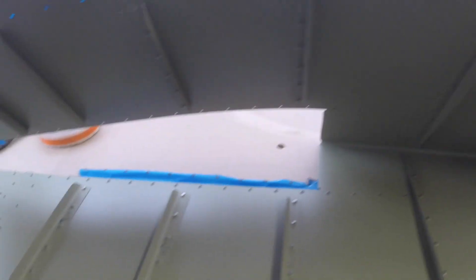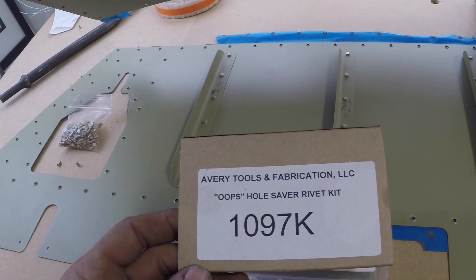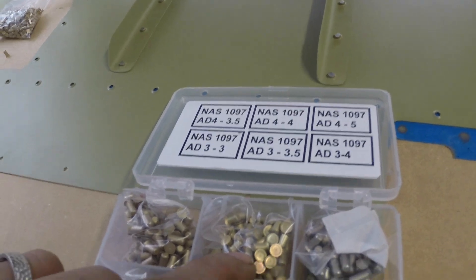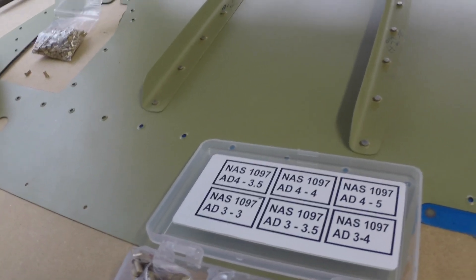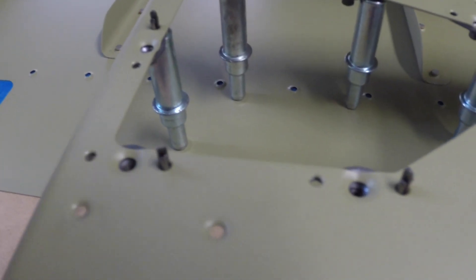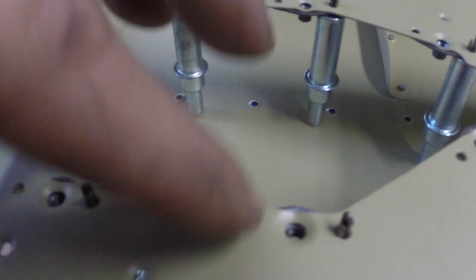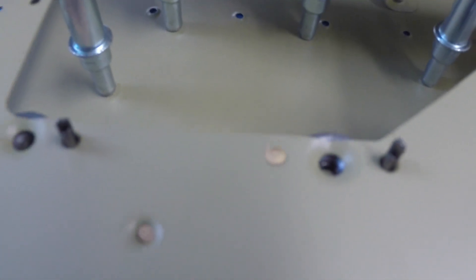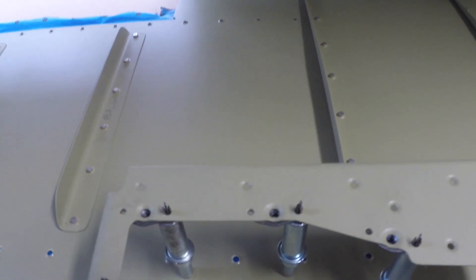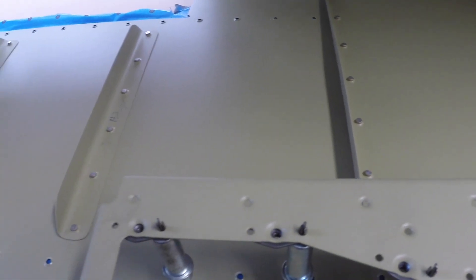If you remember from previous videos, we're going to be using the Avery Tool rivet saver kit. These have extremely small flanges — you'd use these if you made a mistake in a number 40 hole and wanted to drill it out to a number 30. The head is the same size as a number 30. I only barely machine countersunk those holes, and here's a NAS 1097-3 — it just fits in there beautifully. I'm going to rivet all these nut plates on, and if I need to grind any down afterwards I'll use a Dremel tool and add a touch-up of primer if needed.